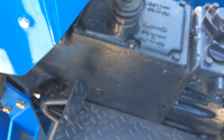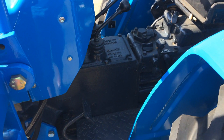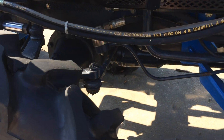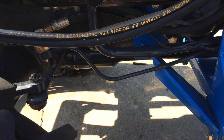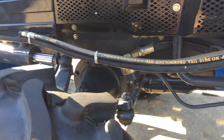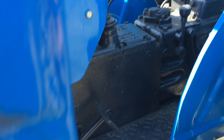You don't want too much in there, because it's going to put too much hydraulic pressure in there and blow some lines, along with a myriad of other problems. Too little and you don't have enough power on your three-point — it's not going to raise or lower. And if you have power steering on this tractor, that's not going to work properly either. So simple enough — right there in the middle.